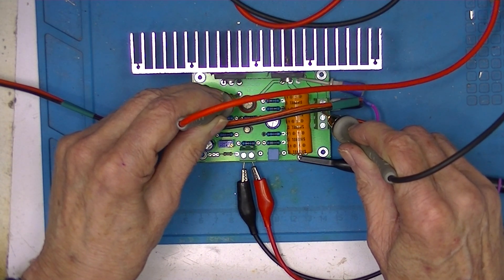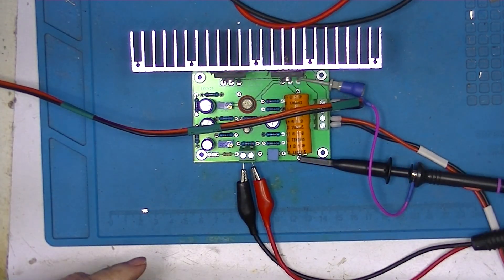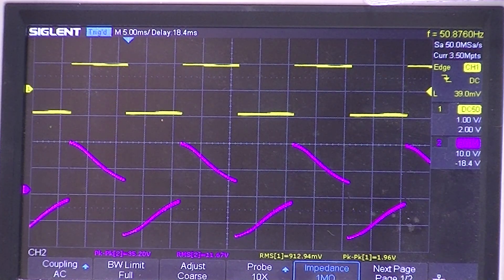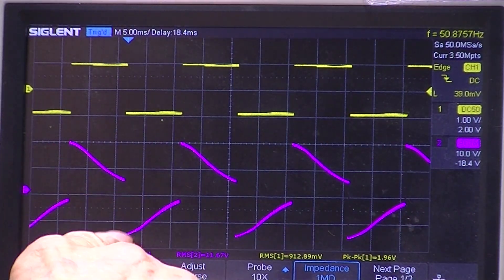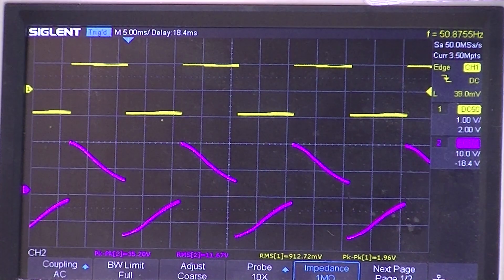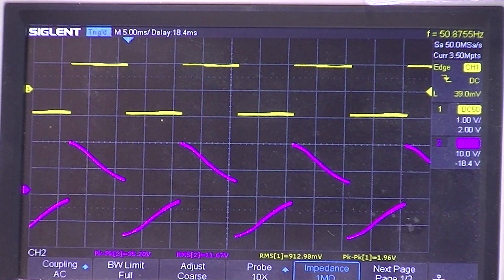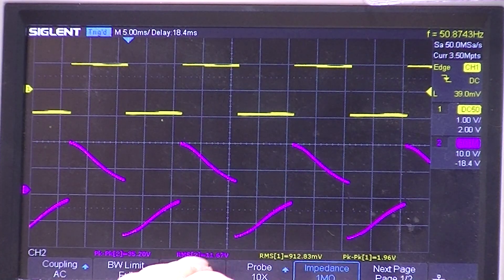For all practical purposes that's 13 volts on the crossover point and one amp of current at 26 volts input. With a 50 Hz square wave going in, this looks very much like the tests done in 1969. Someone said I couldn't get 10 watts out of this, but I'm inputting a little less than 1 volt RMS and outputting 11.5 volts.